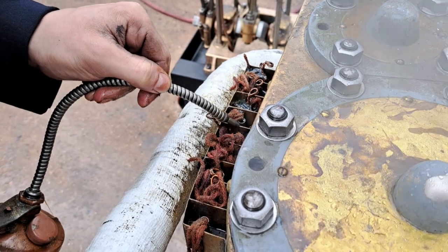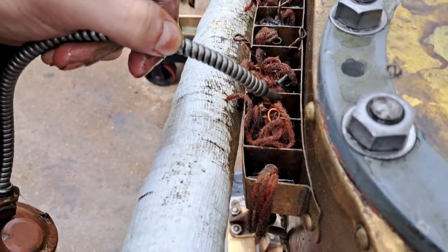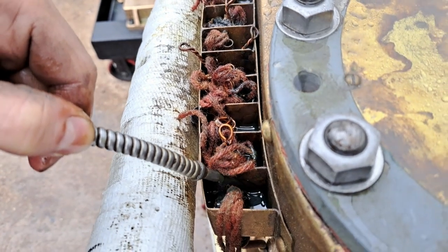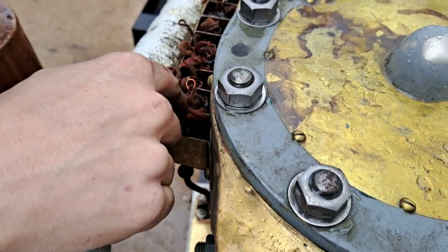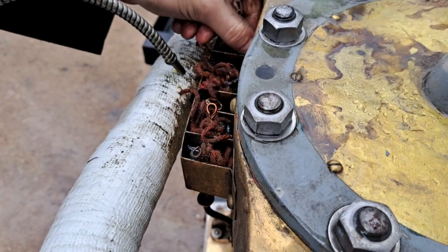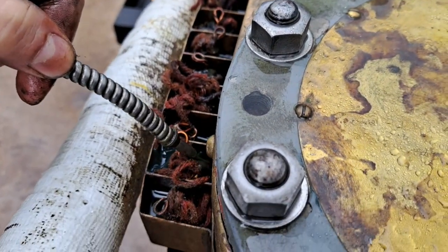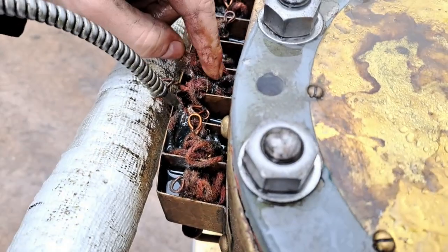The hot well. They're not really my speed, but they do have very nice comprehensive oil systems with these nice multi-chambered boxes for the wicks. Just got to make sure everything's where it ought to be. This is how you start a wick oil — you just put the wick down the tube, and when you don't want it to feed anymore you take the wick out of the tube. These little metal followers — got a couple of spares, too.